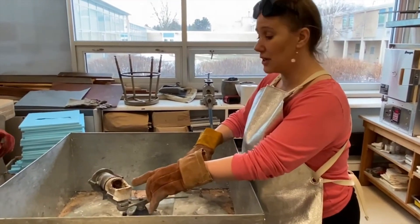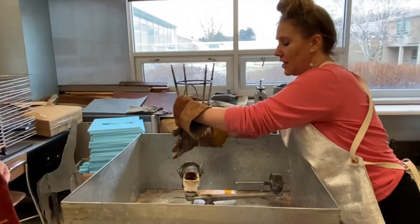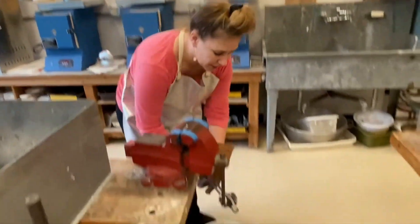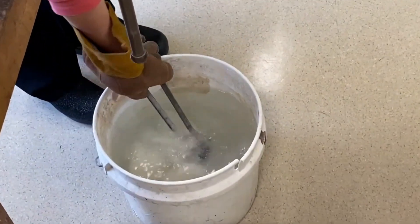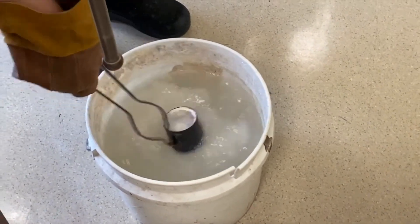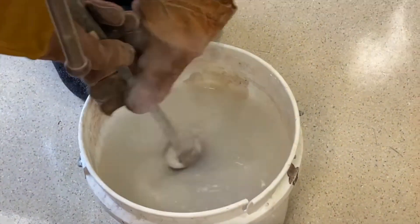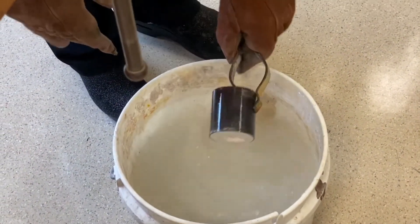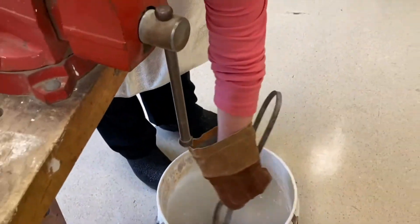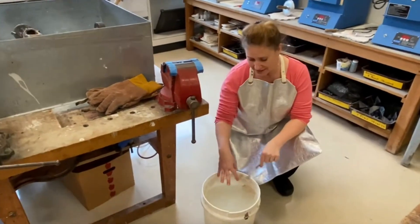There's no more metal in the crucible. I'm going to take the same tongs and pick up the flask, then with my gloves I'm going to quench it into this bucket. I ended up with a button. What happens is the flask is so hot that the water around the investment starts to boil and it breaks open the flask. In about two minutes we're going to reach down into this bucket and release the mold from the cast.